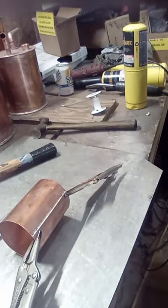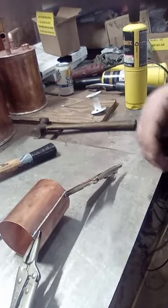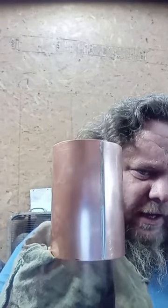I'm going to let that cool just a minute. As you can see, it is already starting to resemble a cup - it's that simple. As it starts to cool off, grab a rag and wipe it off. Get rid of that flux before it gets cold and sticky again. The seam is now soldered. Notice there's not a lot of extra solder on it, and none ran to the inside to speak of - nothing that's going to cause any problem.